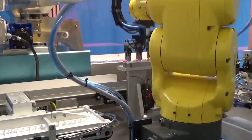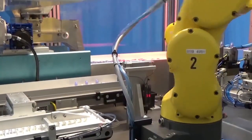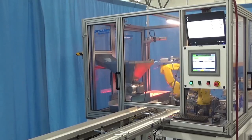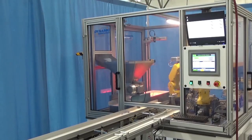A rigid backbone piece is then picked from a conveyor with vacuum end-of-arm tooling and is placed into a secondary nest where the robot places the valve assembly into the backbone and offloads the final assembly onto the offload conveyor.